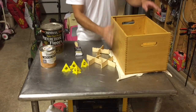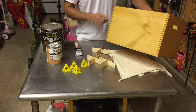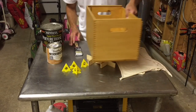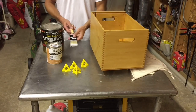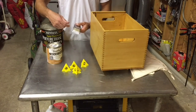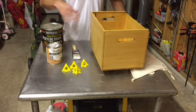For my finishing process, after everything is sanded, I like to put on an oil-based stain by Varathane called Summer Oak. I think this stain looks fantastic because it makes the pins contrast really well and it's a lighter coating that looks more natural. I like to elevate the box while I'm doing my work, and I use a dollar store paintbrush — a 2-inch, so it was $1. If I want to take a break and I'm doing a few boxes, I'll just wrap my brush in a plastic bag from a grocery store real tight, throw it in the fridge, and it will stay wet for a few days.